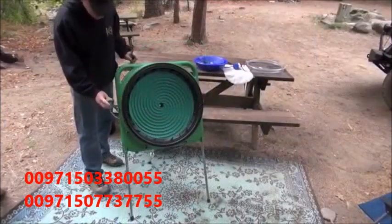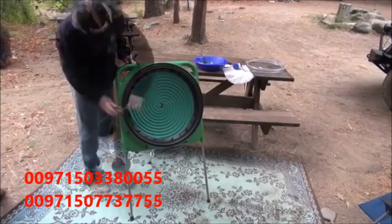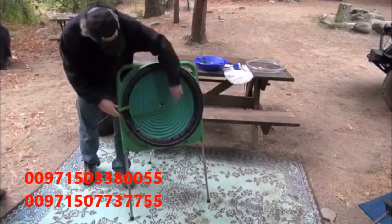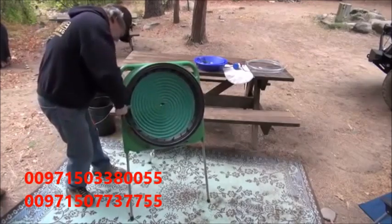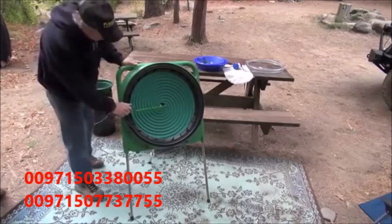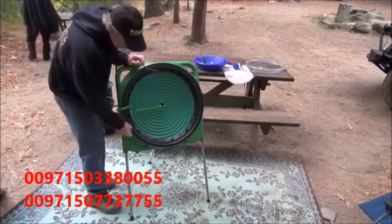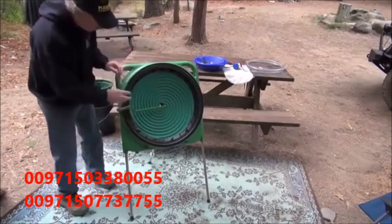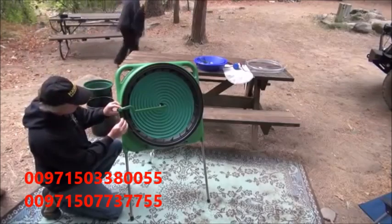The next step: I'm going to take the spray manifold and just slide it in through here. You're going to adjust your spray bar in and out by doing this. I like it a little closer — that's about right. Now these tubes here, they help keep the material from building up in the bottom crack in here and help keep things clear. These just slide on — usually just a friction lock, that's all it takes.